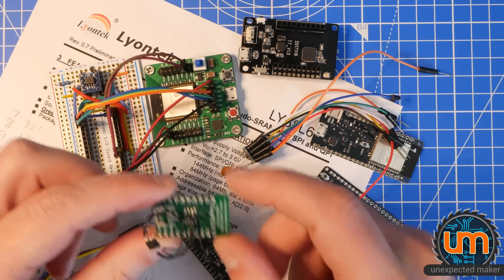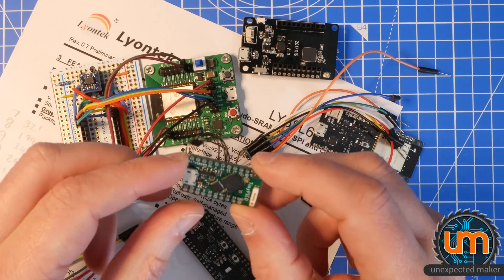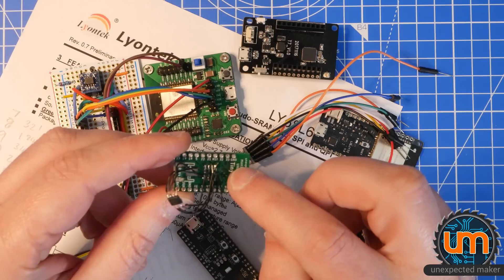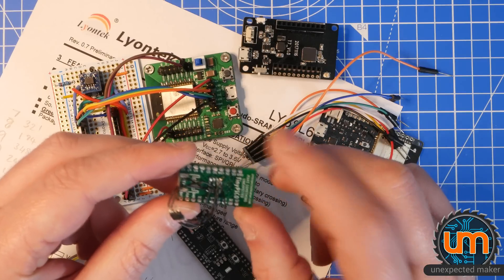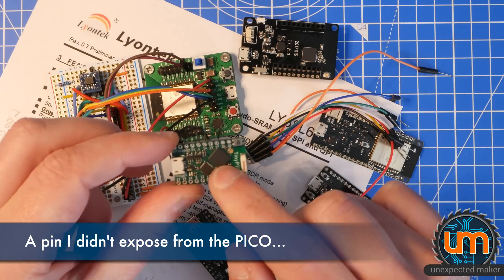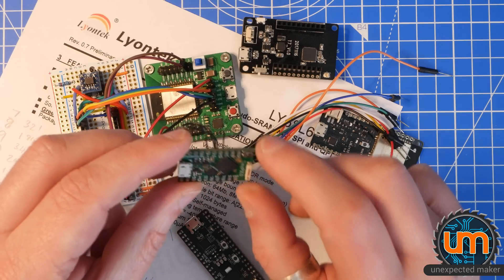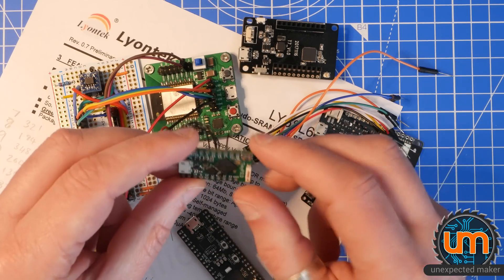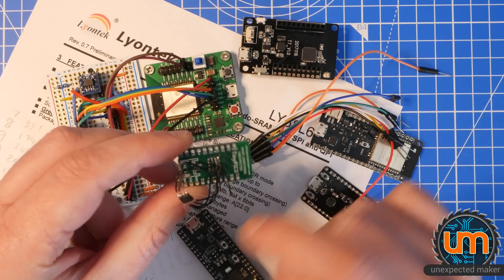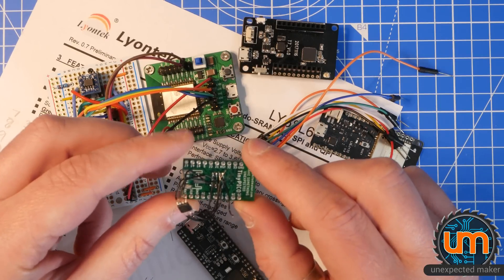Let's start off with this little sucker. That's my Rev4 board, and my initial attempt at a pinout on the back. The pinout is wrong. There are a couple of pins that I need — at least one pin — that isn't exposed from the Pico, that I just can't get to with these pads on the side easily. Not without damaging a board, and then I'm never going to know what the problem is. So my attempts at sticking PS RAM on the back didn't work, and my attempts at rewiring didn't work. But I have found a combination of wiring now that is supposed to work.